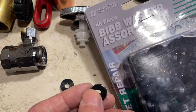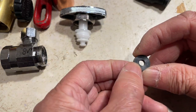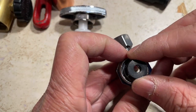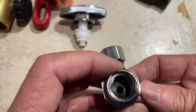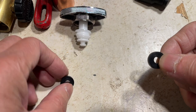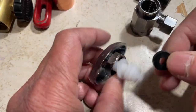I found this kind of washer supplies assortment and they could be a wee bit bigger, but as long as it fits into the valve seat — when you drop it in and it fits — that'll be fine. They should be flexible ones like the original equipment, so that's all you need.